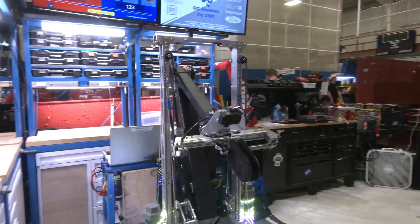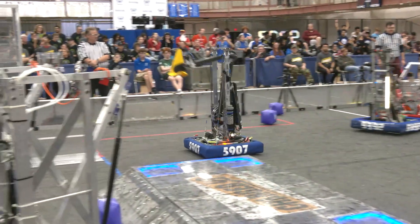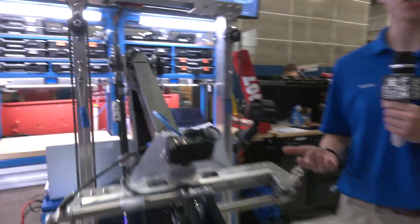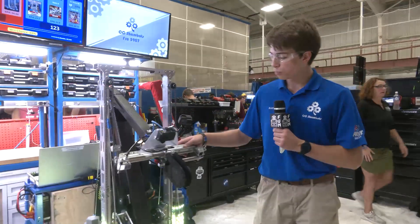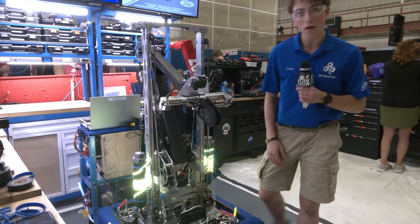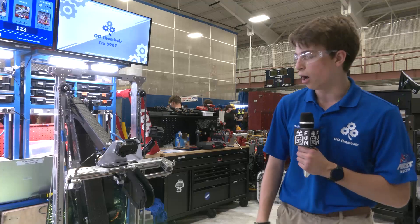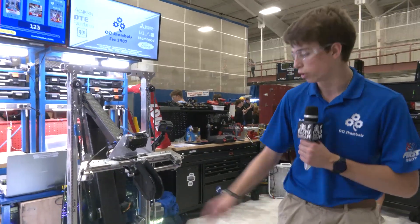I noticed when watching your robot that it's surprisingly stable — even with your arm out, you were able to move and score. Can you talk about how you approach stability? That was a big part of our iterations. We found that the most precise way to control motors is with the Motion Magic system on the Falcon 500. We redesigned our chain drive to get a gearbox with enough precision to use Motion Magic. By using Motion Magic and reducing the slop between the motor and the actual arm movement, we keep the motors at the precise position we want, which keeps the arm stable. That was one of our biggest struggles — arm bouncing — and in the off-season we've reached a really good point with the new gearbox and pulley.